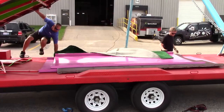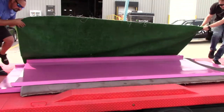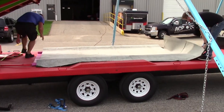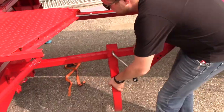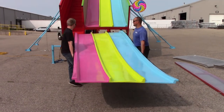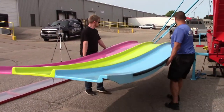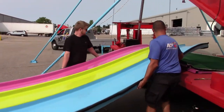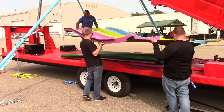On the top flat runner section, drape the outdoor carpet over it with the soft side facing down. This will protect the flat runner sections from getting damaged by the removable slide section. Next, crank up the stabilizer jacks on the support arms and push the arms back into the trailer frame. After the support arms are out of the way, carry the removable slide section to the base of the trailer and place it on top of the two flat runner sections.